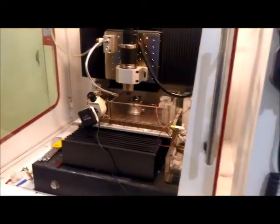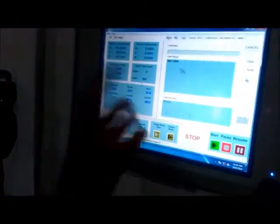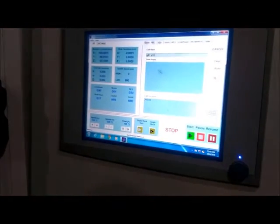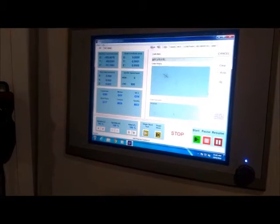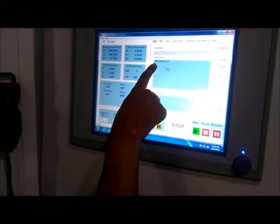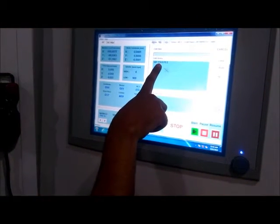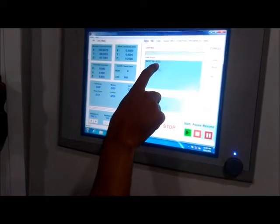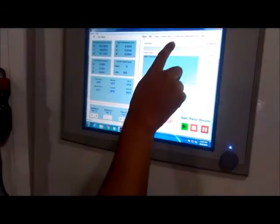Now the spindle is rotating at high rpm and you can see here that spindle speed is 900. Then I have to give the Y feed, and the feed rate should be very small. G01 is linear interpolation, Y is 10 mm and feed is 0.3 mm per minute.